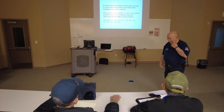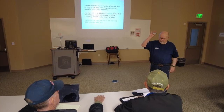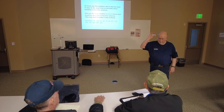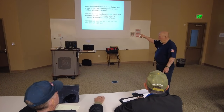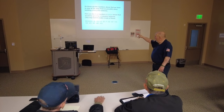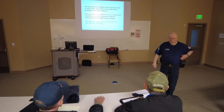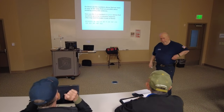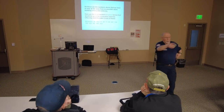Thank you. I've got two end-feds running out at the Navy base for the MARS station out there. One of them is 148 feet, and the other one is 203. Wow. So I've got one that's for like 7 meg, the shorter one. The longer one is for the 3 meg. Okay, I understand. Go ahead.